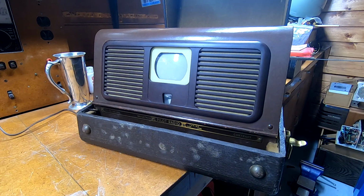Now, when I went to the event, my buddy there had a custom-built modulator rack with individual agile modulators to convert each different over-the-air digital channel into its normal analog version for 2 through 13, so that he could then directly connect with coax to any TV and be able to flip through channels just like you were doing it back when analog was still on the air. I wound up just siphoning off that system for the sake of simplicity, because I did bring my own modulator and equipment, but my signal source wasn't great.